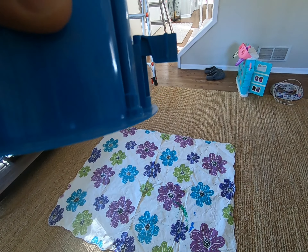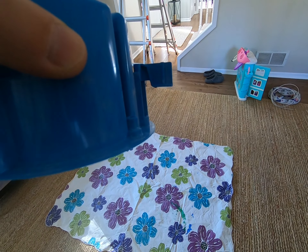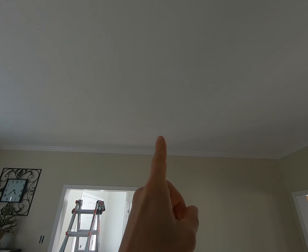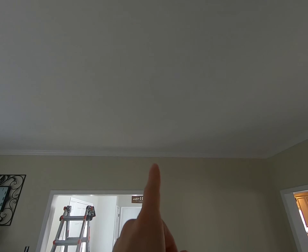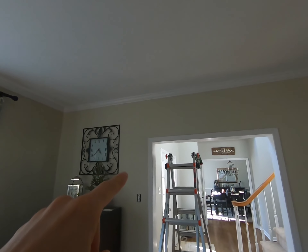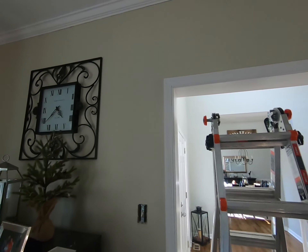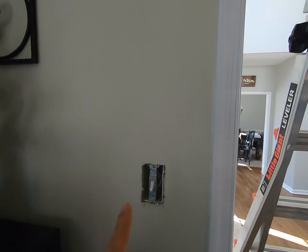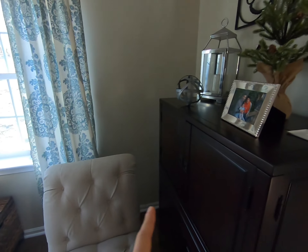We're going to put the electric box right there, then run right down the joist. I'm going to pull down the crown just a little bit so I can cut and move my wire behind it and down into the power supply. This current single-gang switch operates one of the outlets, so we're not going to terminate that.